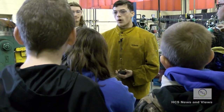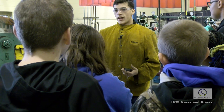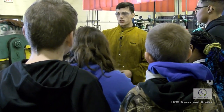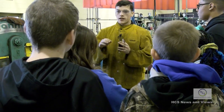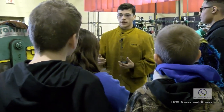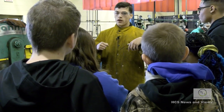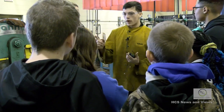There are three different types of welding we do in here. There's stick welding, which is what you'll start with - you have a rod, and as you're using it, the rod burns down. Then there's MIG welding, where you have a gun, pull the trigger, the wire feeds out, and the heat burns the wire off, creating the weld. And then there's TIG welding, where you have a little torch and a separate rod that burns down as you use the torch, unlike stick welding where you have a stinger.